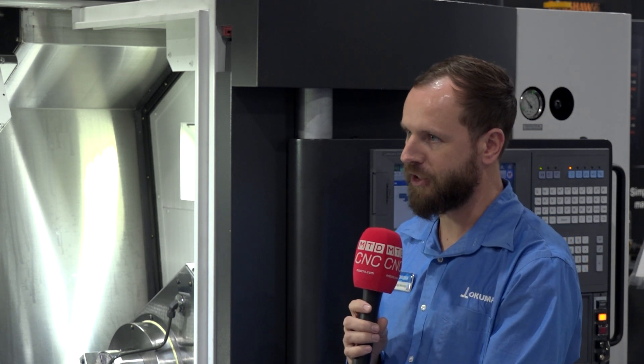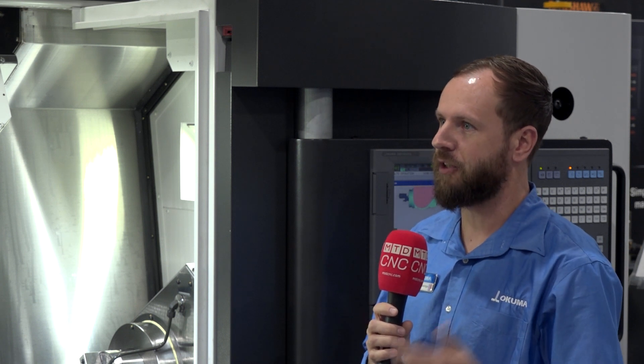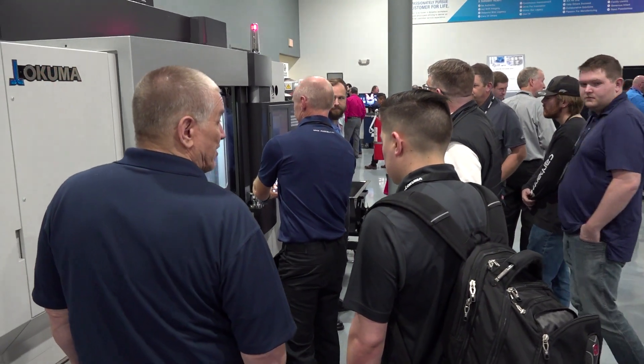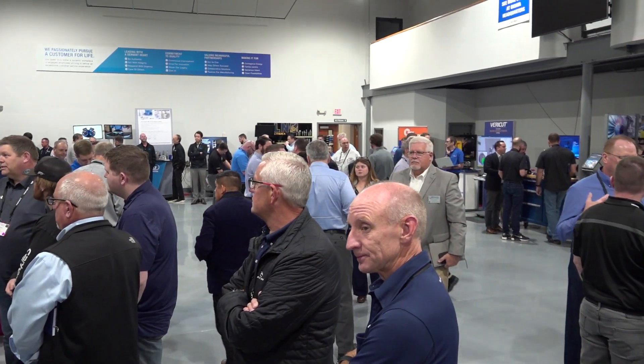This gives you either 3+2 machining ability or true 5-axis machining ability on both sides. We've even had at this show somebody running two 5-axis mills — a little bigger machine than this — who wants to come in and see their part being made here, transfer over and do 5-axis work here, but it's a mill part.